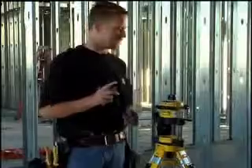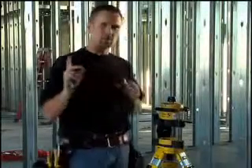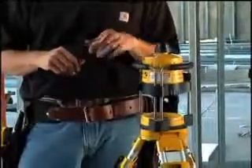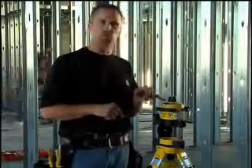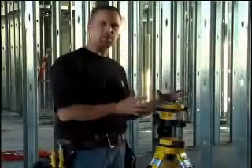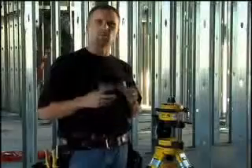It turns about one and a half times, and then it's self-leveling on the inside. As soon as this laser spins, it's level. Now the whole time we're talking here, there's a Y-light on here that's blinking. What the laser is telling us right now is that it's giving us about 30 seconds to get it positioned where we want it. After that 30 seconds is up, that light's going to go off, and then it's in what we call high alert.